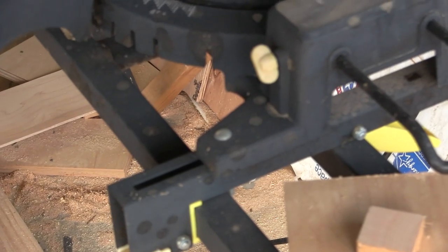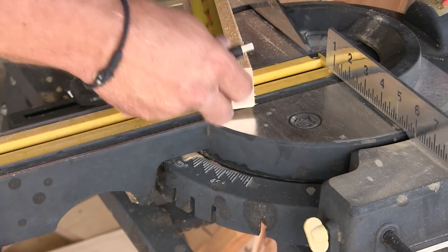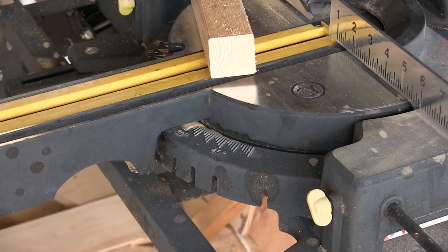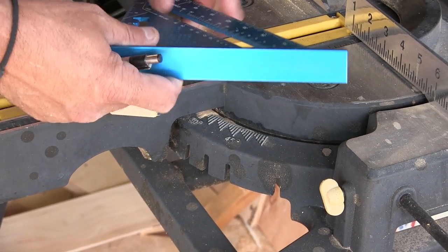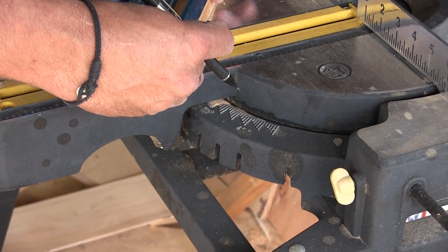So set the door on. Oh, so it's 5/8 inch off the ground. Gotcha. And then it leaves room for our little flooring. For the flooring, yeah. And then an 1/8 of an inch more. So I'll make two of them to set the door on.